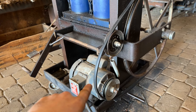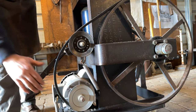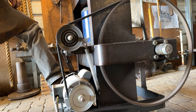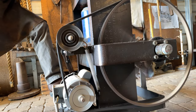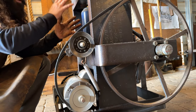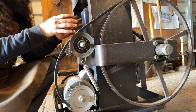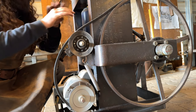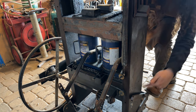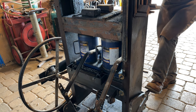But enough talking — let me fire up that electric motor. I have it hooked up to 220V and you can get a better idea of how it functions. As you can see, this electric motor is currently spinning but the belt is not trying to grab. But when I do this, it locks it up and it pumps the heck out of those jacks. Normally when I'm actually working on a piece of steel, there's enough pressure resisting the jacks so I don't have to stop with my hand — it just kind of stops on its own. As I'm pushing down this pedal, the fulcrum here transfers my energy upward, which pulls the cable, spins the valve, and then these springs reverse and bring them back.